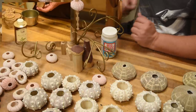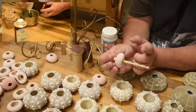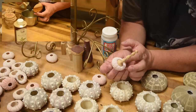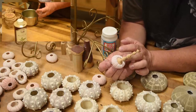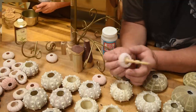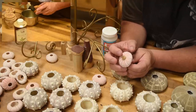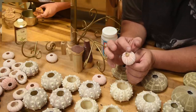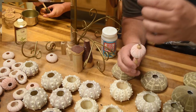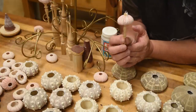For the pinks, the ones we're about to do now, the idea is you have one finial, you have all your decorations on it. The bottom of it, this distance right here, is going to get very close to the size of the larger hole, and the top is going to be made up of a slight tenon that's just going to fit perfectly on the inside. So the finial itself just slides up on top of it, and you can attach it to the screw right there. It is one item.